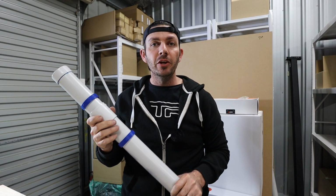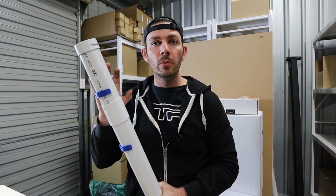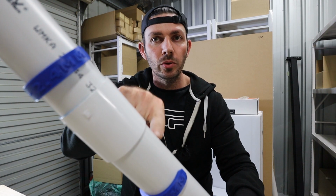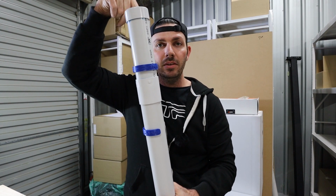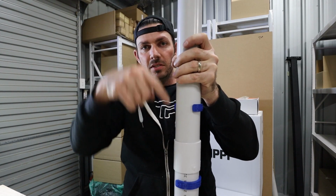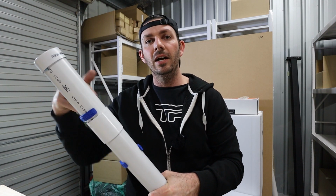One of the reasons I made this video when there are already so many PVC pipe TIG rod holder videos on YouTube, the thing that I noticed on almost everybody's variation was they had the joiner coupler, this piece here, glued to the main pipe instead of glued to the cap. The whole point of this is to keep moisture out of the welding rods, and having the join open this way, if water was to seep down the tube, it would end up inside the tube versus having the glue on the top side. No moisture can seep down into the tube.